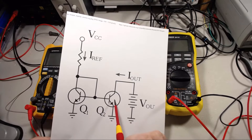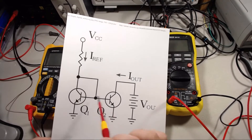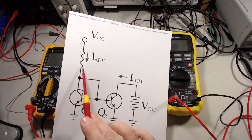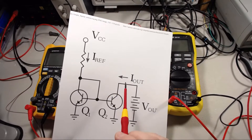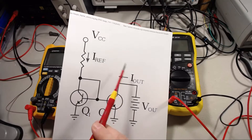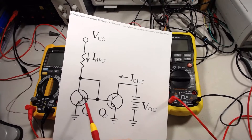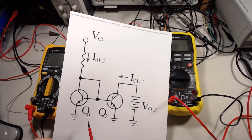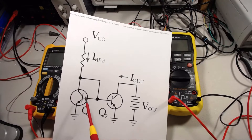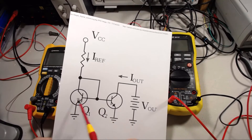I've read in several places this only works fairly well with integrated circuits, because if they're on the same silicon you'll get closely matched transistors. With discrete transistors I have a feeling we'll see some difference in gain between the two, which will throw off the mirroring effect. We'll probably expect the output to be a bit smaller or higher than the input. Another problem is if either goes into saturation outside their linear zone, it probably won't work correctly. Also, transistors change their gain with temperature quite a bit, so it would probably work better if both are mounted on the same heatsink or glued back to back.